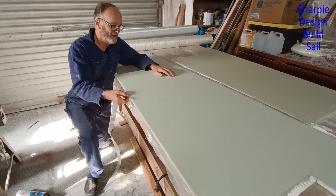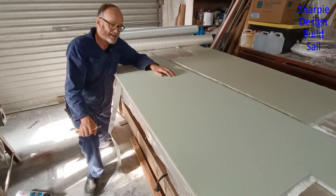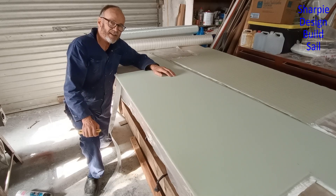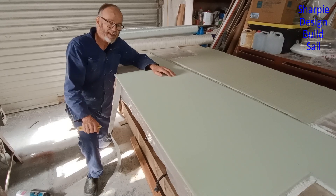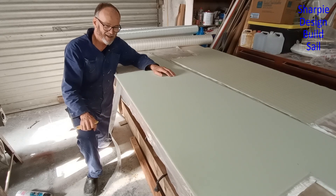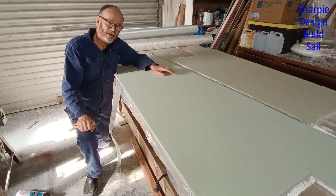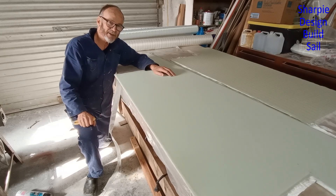When you're trimming off glass like this off a panel, it certainly pays to do it while the glass is still pretty green. I did this late yesterday afternoon, so it's the next morning — it trims off quite easily. I'll probably leave that last bit for sanding. The sanding is a really big difference actually. I was quite surprised at the resistance to sanding that PET has — when I cut it with a jigsaw after I'd marked it, I wanted to trim it down with the sander. It took a lot of sanding on my orbital sander with some really rough sandpaper before I could get it down to the line, and I would have been able to do the Polonia timber in a quarter of the time. In fact, I would have had to be careful not to over-sand — not so with this stuff. Anyway, this afternoon I'll do the other side of these panels.